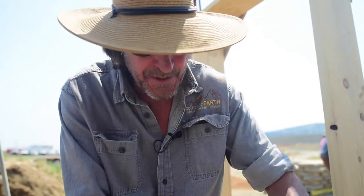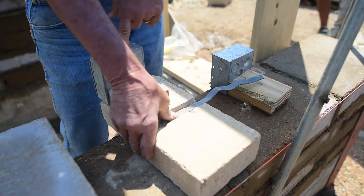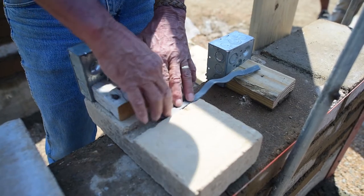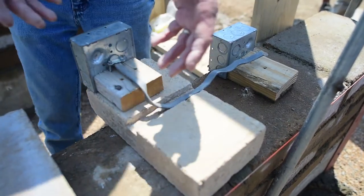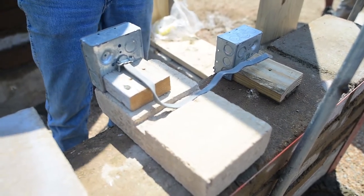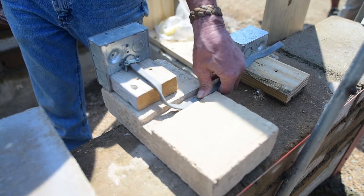The wire comes out of the box and goes down in that trench, and takes off to the next box or wherever it's going. You can then staple this down with electrical staples into the trench. One of the beautiful things about this is that your electrical wire is buried in the center of the wall. If you have a 10-inch wall, it's five inches deep in dirt. If you have a 14-inch wall, it's seven inches deep in dirt. So it's never going to catch fire and it's never going to get hit with a nail. It's real safe.